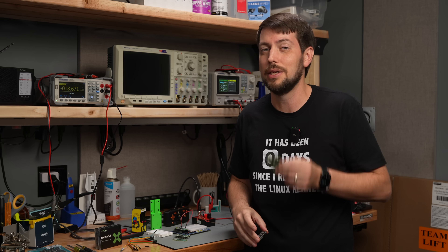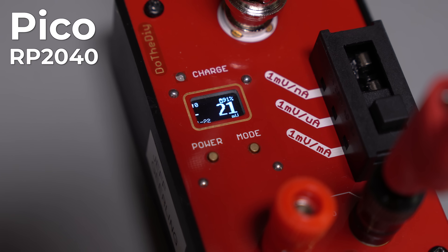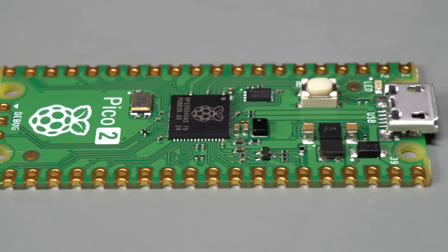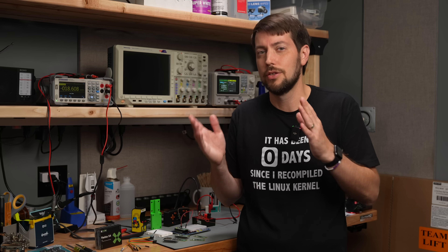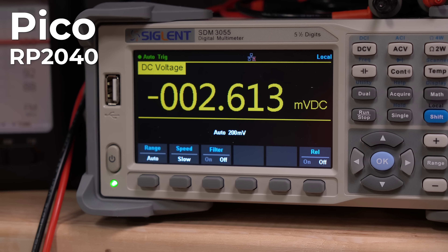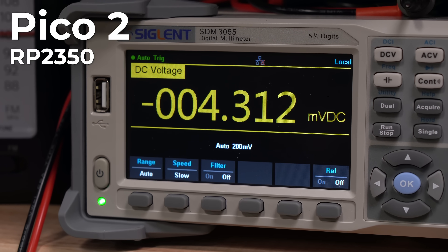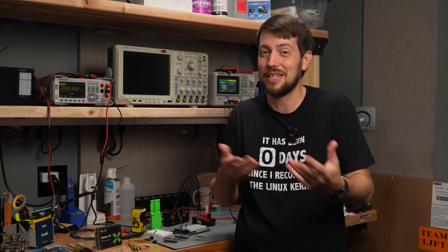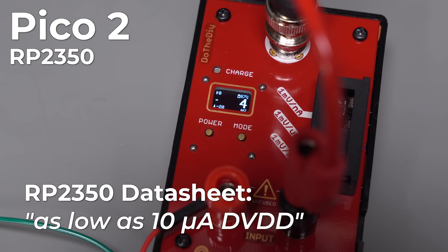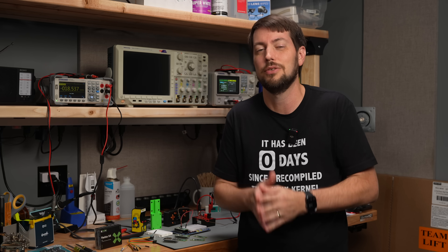So is the Pico 2 better than the Pico? Comparing them running a simple C program that blinks the onboard LED: the Pico runs between 20 and 22 milliamps, or about 100 milliwatts. The Pico 2 runs that same code on its faster cores at about 16 milliamps, or 80 milliwatts. So we're already seeing better power consumption when the RP2350 is running. For sleep, my Pico got down to 2 milliamps, but I was having trouble getting the Pico 2 to sleep — probably my own fault, since I'm working with pre-release software. The lowest I could get was 4 milliamps, but the datasheet says it can get down to 10 microamps, which would be a huge improvement. If I can get sleep and dormant working, I'll post my measurements on my blog.